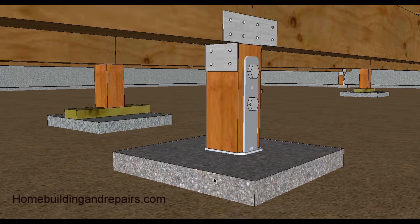You're probably going to want at least two inches from the top of the soil to the top of the concrete. Some building inspectors or engineers might want to see six inches, but that's hard to say. If you make something six inches off the ground, you might not have enough room for all your connectors or piers, especially with an 18-inch crawl space.